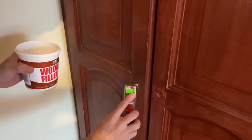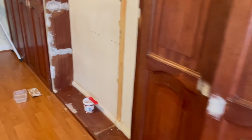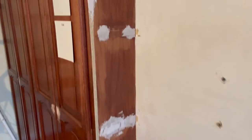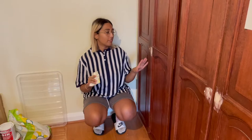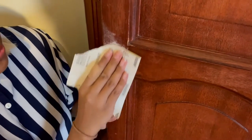I really can't stress how important preparation is - just making sure you have the ultimate smooth finish for the paint to go on. We've filled up a lot here. We've literally filled all the holes and right now this is dry. We just need to sandpaper it. I'm using a 240 grit and just by doing that it's already gone really smooth.